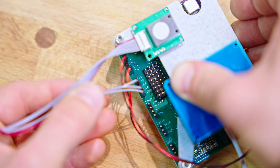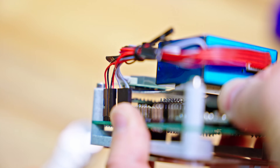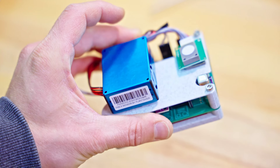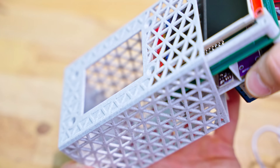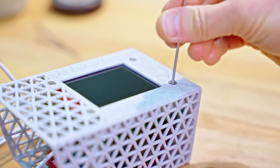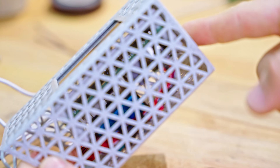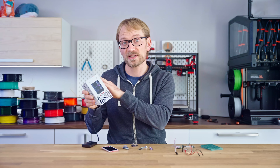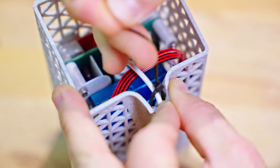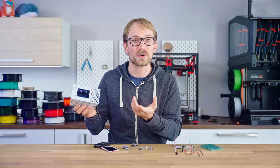On the other side, plug in the screen, and the holes should line up just about perfectly. Use a 25mm screw from the sensor side to sandwich the PCB between the rear shelf and the screen spacer, then mount the wired sensors you're using onto the shelf — that would be the ZE08, PMS, or MQ7 if you want to use one of those. Make sure you've got a USB-C cable plugged into the ESP to supply power, then carefully slide the assembled sensor block into the outer shell. Use M3x10 countersink screws or whatever you have on hand to fix the electronics unit in place. You can use a small zip tie for some strain relief on the USB cable, and with that, the sensor box is complete.